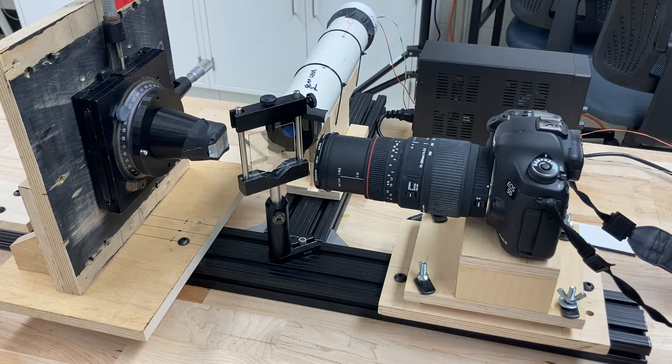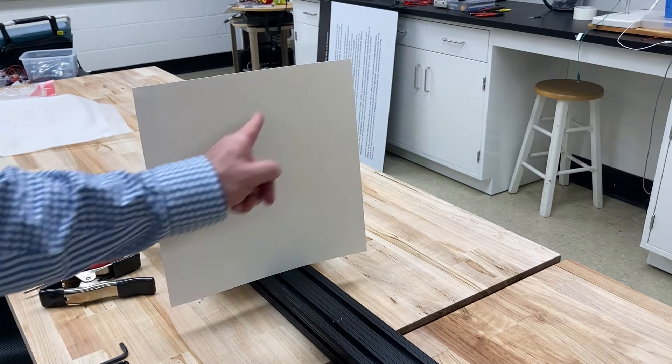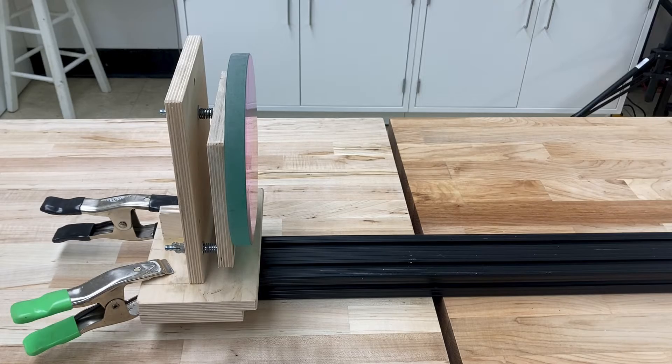When I do this, we're going to go back to a dark room again and make sure that this white card — the light source — fills this up. You can see that the light source is not aligned correctly, so this has to be about right there in the position, filling up the center of the mirror. I'm going to lock that beam splitter down so it can't move around, and now I am ready for the next step. It turns out this next step you can actually do with the lights on after we've re-aligned this — aligning the mirror with the system. The system is changing these positions so that the two light rays exactly overlap each other. This is really best done by putting the camera on some sort of remote viewer or screen, so you can look at that camera screen as you are aligning everything.